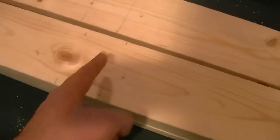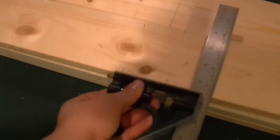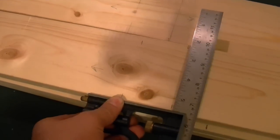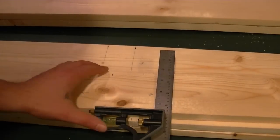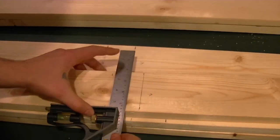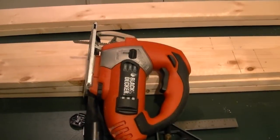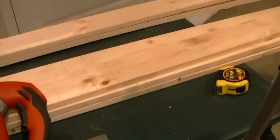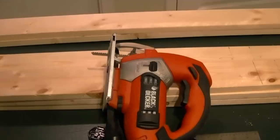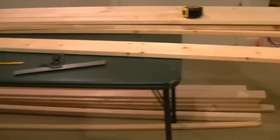I got my arrows where I'm going to be cutting. I'm using this tool to make my straight lines all the way across. You basically take your tool, butt it right up against the flat edge, slide it along, and use your pencil to mark right across at your 47-inch mark. I do have a circular saw but I'm going to be using my Black and Decker jigsaw because I'm in the basement. It's got a really nice wood blade — make sure you're using the right blades for the right job.